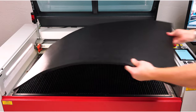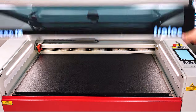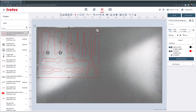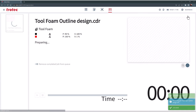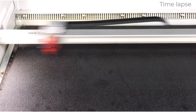Once the test cardboard is confirmed, place the foam into the laser system onto the vacuum table. Position the design over the foam using the red dot pointer or overhead camera shown here. Now select the foam parameter from the materials database, then push the file to the laser. Push start to laser engrave and cut the design.